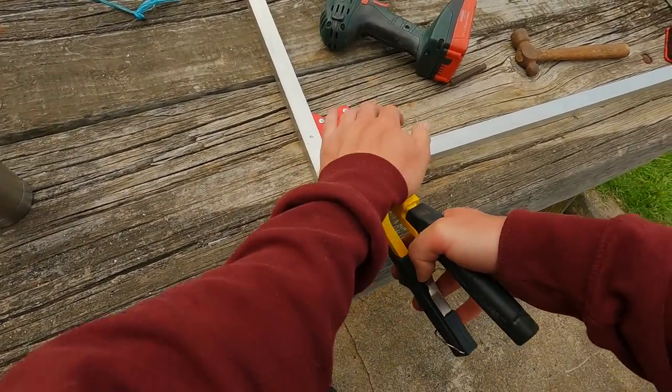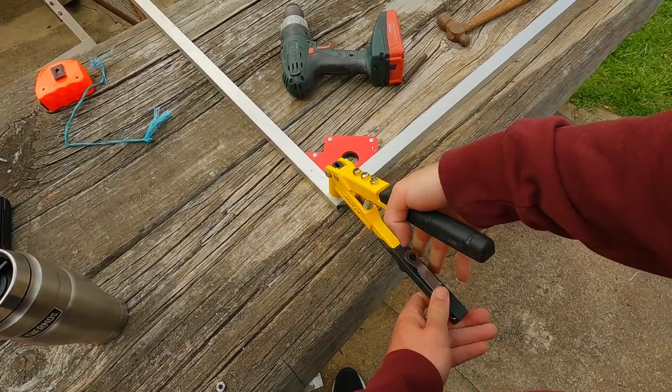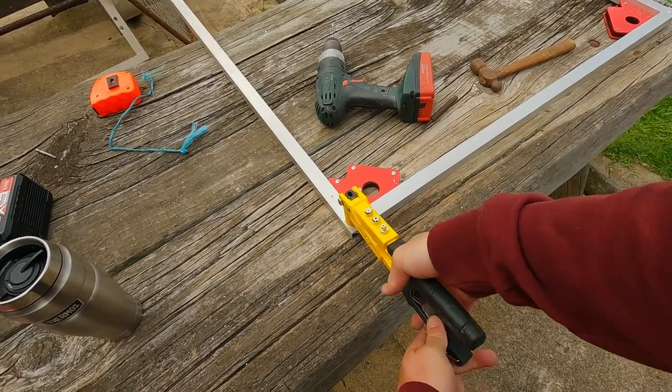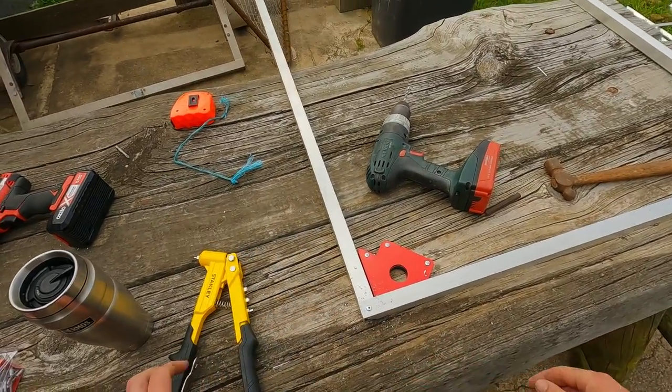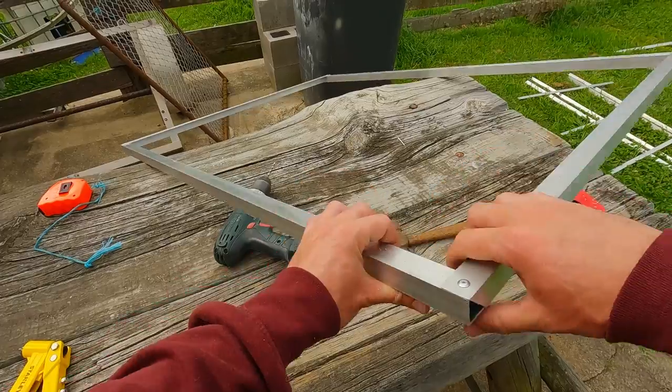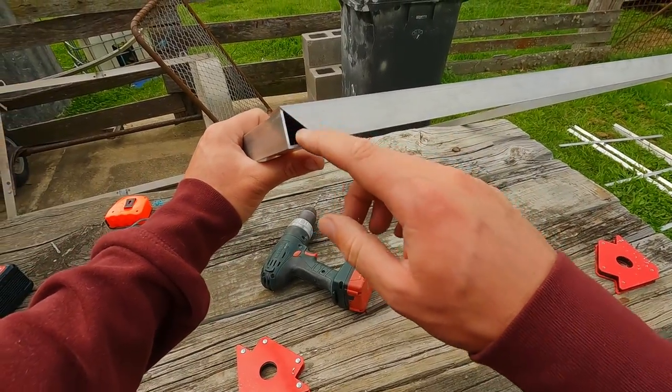And next piece is the bottom rail of the cart. So we've just got square tube forming the sides and then some right angle at each end. You'll just see here I've cut the right angle at 45 degrees using a miter saw, and that's going to marry in with another bit later on.